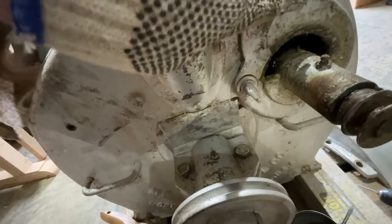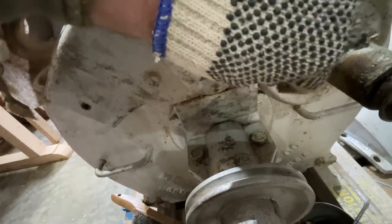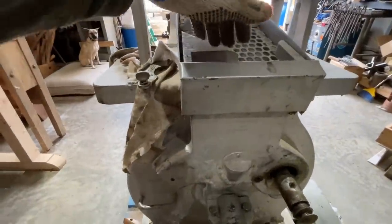There's a vent right here that you can open up to allow the airflow to the fan, or you can close it to keep the mill closed up, to keep anything out of there. But anyway, on this mill, when you open that fan gate, it allows that fan to take a current of air in, and it blows it across right here. And this is where the grain falls down.